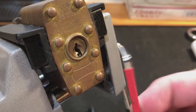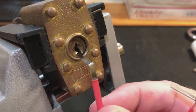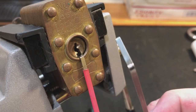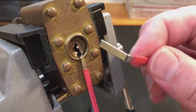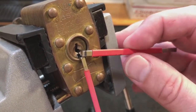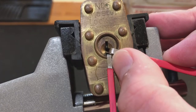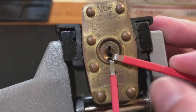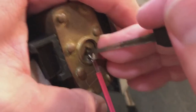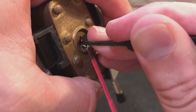If you don't have one of those and you have one of these smaller wrenches — this one came with the PXS 14, as did this narrower one — you can do this: take the narrower smaller tensioner. If you don't have one of these, you can take a piece of narrow wiper insert and use it as well. Then take your wider tensioner, slip it in the keyway from the side, so the wider tensioner is leveraging off the narrower thinner tensioner in the bottom.